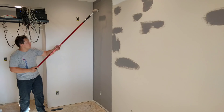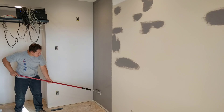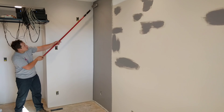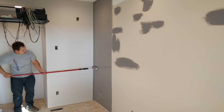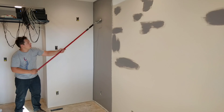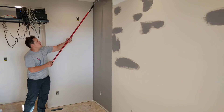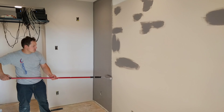All this is doing is making sure that everything is spread out really evenly. You shouldn't have any roller marks whatsoever on the wall after you back-roll, as long as you back-roll very carefully and do a visual inspection. You will see a little bit of what looks like paint lines initially as it dries, but it's not anything to be concerned about — as long as you don't have any ridges of paint, you're going to be just fine. Make sure you pick up your roller and set it back down again; don't work your roller back and forth by turning it on the wall.